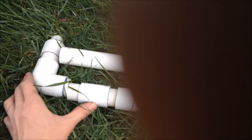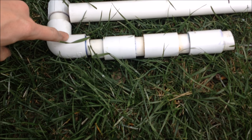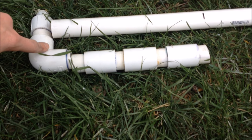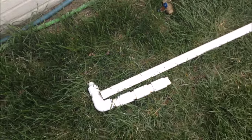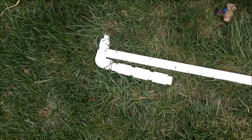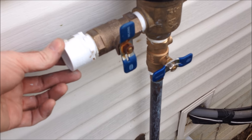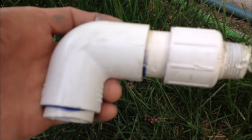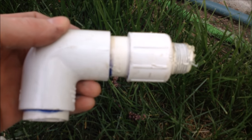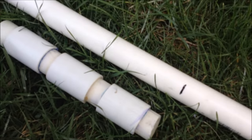The next step was figuring out the length of pipe I'm going to need to replace this piece. I'm basically just doing a guesstimation — this doesn't have to be perfect. Keep in mind that this pipe is going to fit to about right here, right where that 90-degree elbow is, so you're going to want to measure your pipe accordingly. I'm going to cut the big pipe and make that horrible spliced-together section disappear. I went ahead and installed this fitting, which is also going to need a little piece of pipe in the center that joins up the elbow with this guy right here. Then everything will be done and we'll be able to test it.